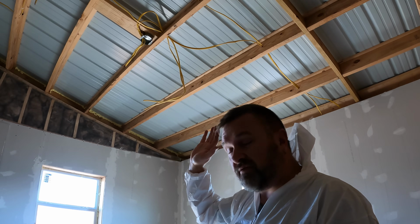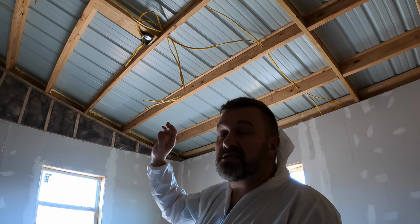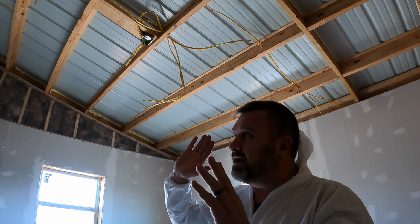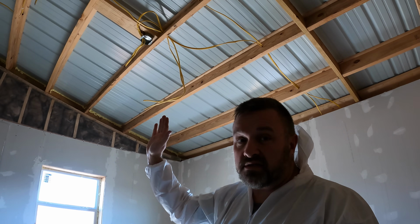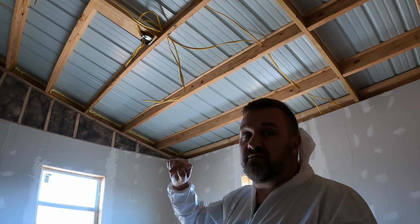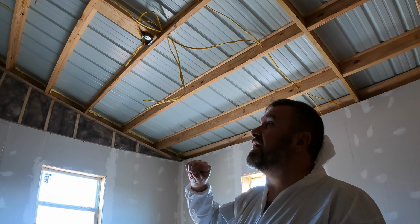I've never done this purple foam before, so this is a learning experience. We got to keep it 12 to 18 inches away. We're in a window of time where the application temperature seems to be pretty correct. It's a little bit warmer, so that foam will adhere and do its thing. So let's try it and see what happens.